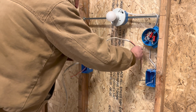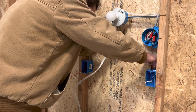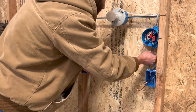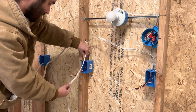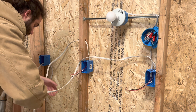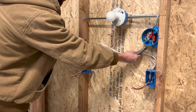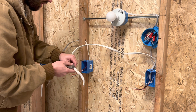So once again, three-wire here. I can get all the wires in the box. So that one right there, followed by one over to here. And then once again, you're just going to strip these to put them into the box. You can staple these if you want to — this is just a demo, so I may or may not be stapling this.